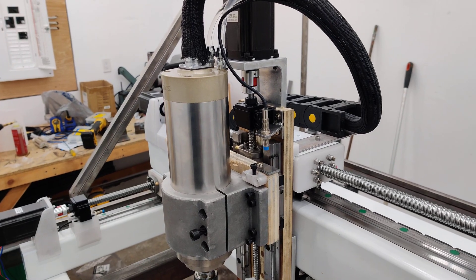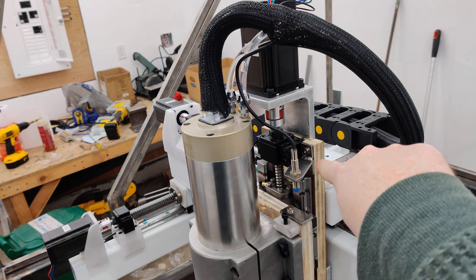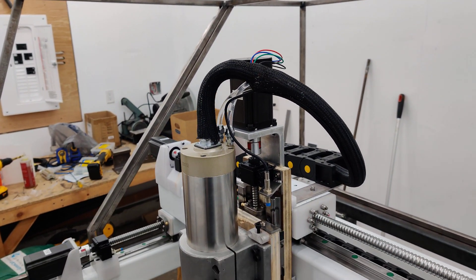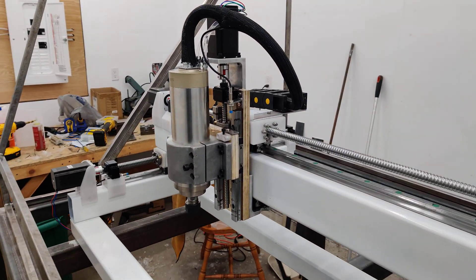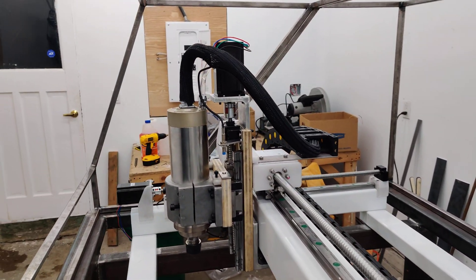I have to limit the amount of the rapids on the Z because this area right here is so thin on the plywood that the whole Z motor just flexes and wobbles around. So I'll have to change our design a bit, at least with that aluminum angle piece.